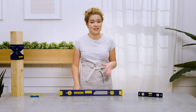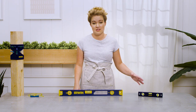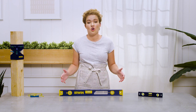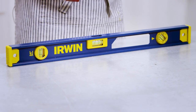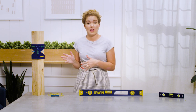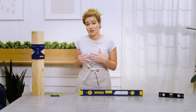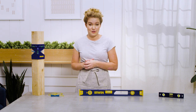If you're just starting to build your toolkit, a torpedo level is really all you'll need for living in an apartment and building smaller projects. A 24 to 36-inch level seems to be the homeowner standard — the larger size means it's more accurate than the torpedo level and it's a great addition to your toolkit. The post level and the line level aren't levels you'll use daily, but if you're building a fence in your backyard, these are the levels you'll want to turn to.